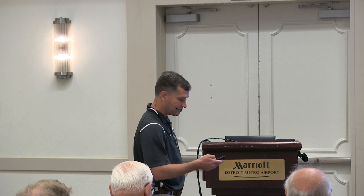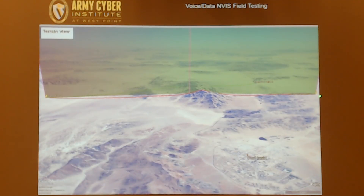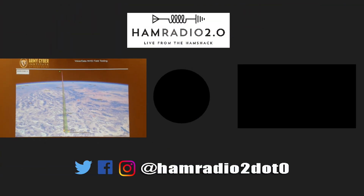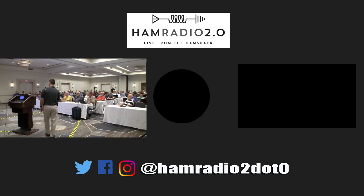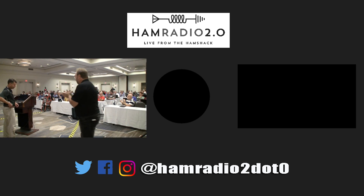I'm a computer scientist so I wanted to do the graphics. I took a KML file just to show the magnitude of what's going on. We're here, we're here, and we're shooting our signal way up here. 100 milliwatts can go up to about 200 to 250 kilometers where the ionosphere was that day, and then back down. Everybody just turn your power amps off when you're doing FT8 — it works really well. Thank you.